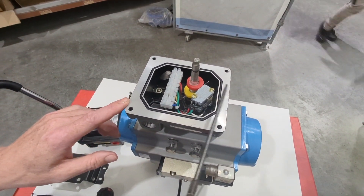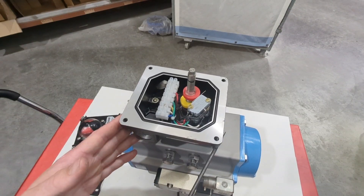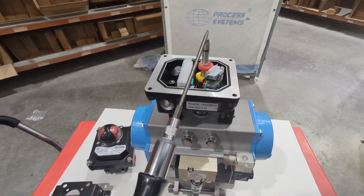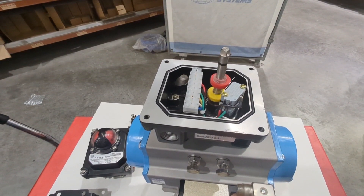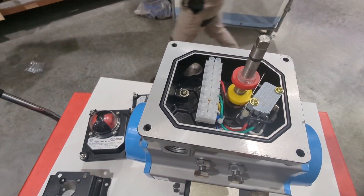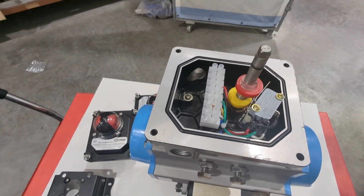One thing to be careful of is the o-ring here — it may stick to the top when you open it up, but it's got a recess it needs to sit in. The actual body itself is aluminium with a powder coat. With the top off you can see the shaft on top moving and the cams corresponding with it. You can see how the cam came away from the switch and the bottom switch is now on with the yellow cam. If you let it go, it's a spring return unit and you can see how it reverses.